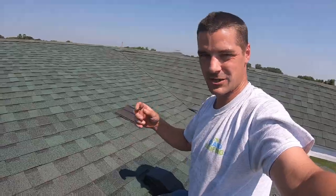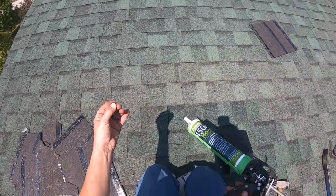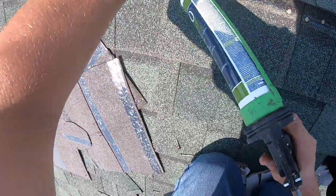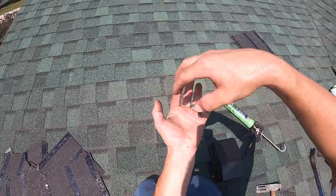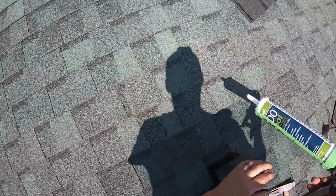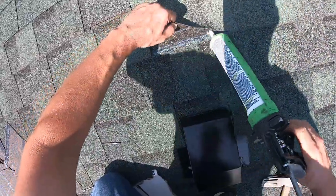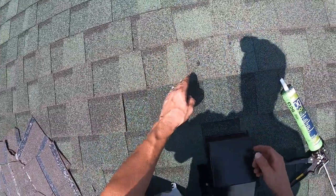If you want good quality at the end of your repair, take a little extra time and a little extra caulking to seal those. Make sure it's something that bonds well — I'm not a fan of tar; this stuff is about seven or eight dollars a tube but it doesn't take much. Put a few dabs near a nail, because when that sealer sticks to the nail head and to the shingle, it's pinned down. Don't put lines where the water runs through or it could track laterally — which you don't want.